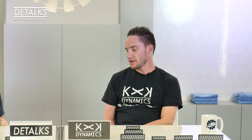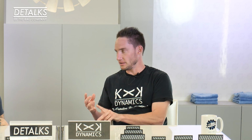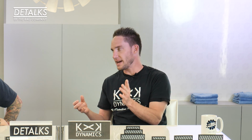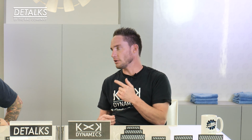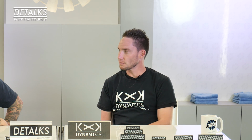I like to hear the machine whine and all that, so I know what's going on. And you can hear a machine, if it bogs down, your pad's probably clogged up. It could be hard paint, soft paint, doesn't matter, but something's not right. Something's going wrong. Something's causing it to stop. So you need to pay attention to what's going on.